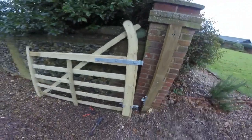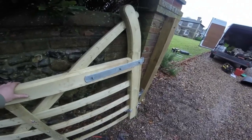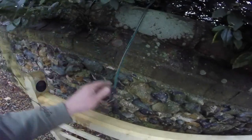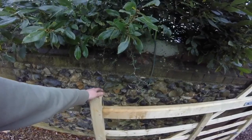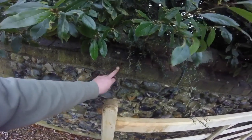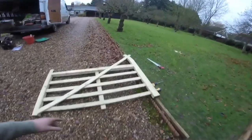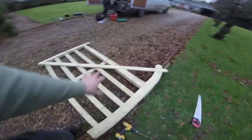I'm going to get on with this other side gate now and then hopefully be able to hang them. All I've got to do today is put the swing-over catch on, and somewhere along here there are probably old holes for it. There are cabin hooks to hook the gates back, and I'm hoping I can do it in there — I don't want to screw it into that spot but we'll see. The other gate's ready and marked now, so we'll get the other bit of batten up the side, get all the hardware on, and hook it on.